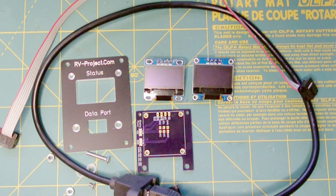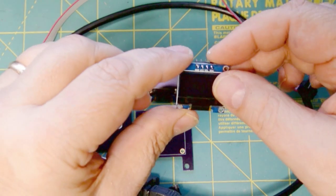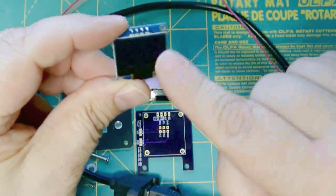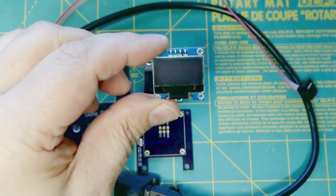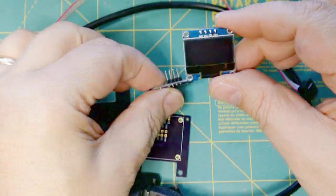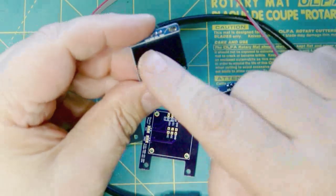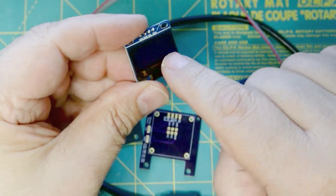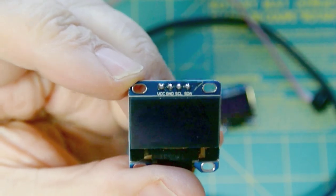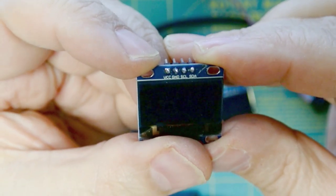At this point I'm going to assemble the display unit. The display unit uses one of these little 0.96 inch OLEDs. It's a small display unit — 128 pixels by 64 pixels — and these are monochrome ones. You don't really want to do a color one for this because the Nano isn't that powerful. When you buy these, you can buy them in white, in blue, and then you can buy a special one that has the first two rows yellow and then the last six rows blue, so you can get different variations. You can see here it says VCC which is 5 volts, ground, SCL, and SDA.